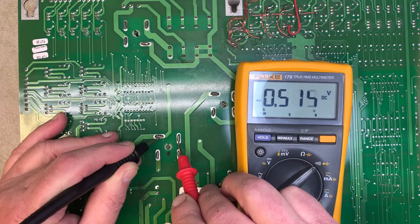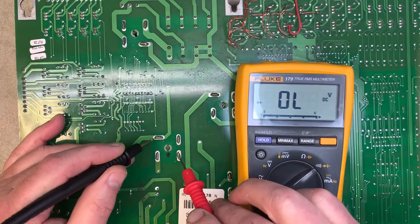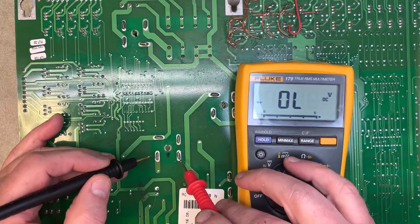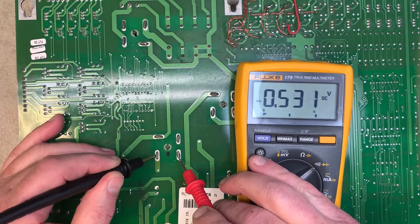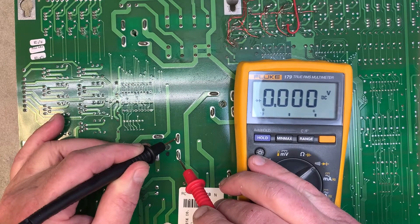This one here is attached to a filter capacitor, so it charges up a little bit, but it eventually settles out in the range you would expect. Now, from the oddball leg to test the other two legs, you go catty-corner — put your red probe there, and then the black probe on each flanking leg. That one's fine.